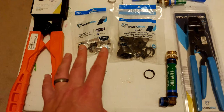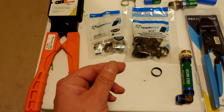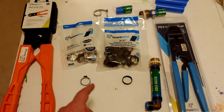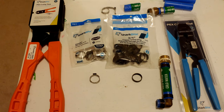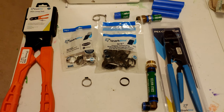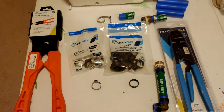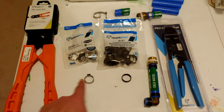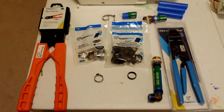These clamps say SharkBite but there are other brands — they're generic to PEX. You might find copper rings made by another company or this clamp style, which may be patented. These happen to be three-quarter inch. I picked these up from Ace Hardware and the others from Lowe's. Don't be deterred by the SharkBite branding — I'm not a big fan of SharkBite push connectors, but these crimp and clamp style connectors I had no problem with at all. I hope this comparison helps you make a decision. I'll probably keep both tools but opt for the clamp style most often.